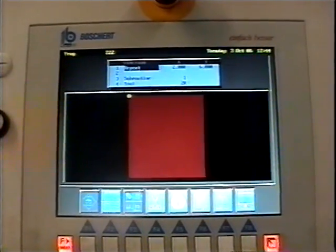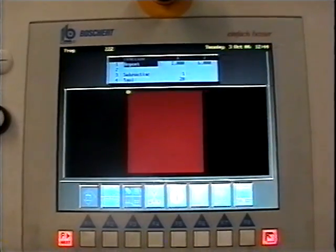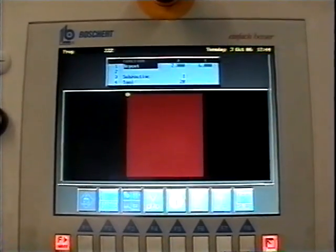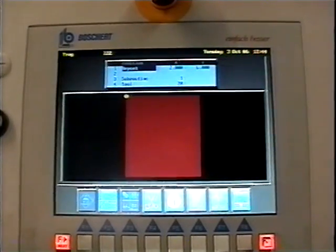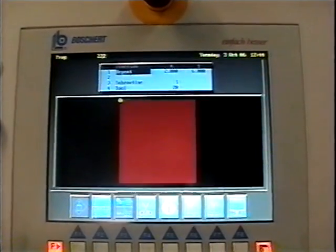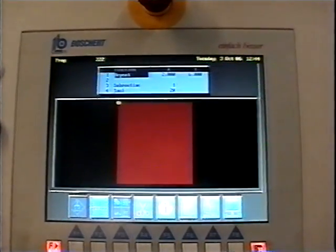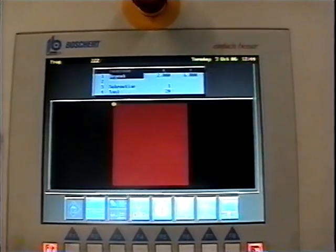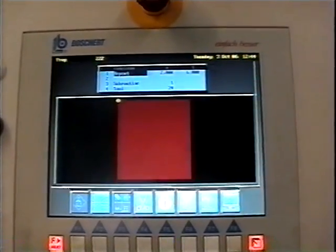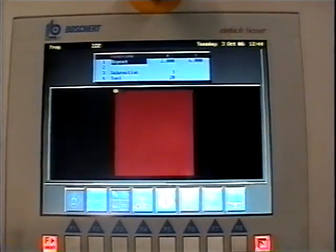It's completely conversational. In the situation where we're running hinges, we have a special tool defined in the library and we've made a very short program — easy to build. It allows you to program both absolute and incremental dimensions for the single hinge from our print, and then repeat it up to any number of times in the X depending on worksheet size, and any number of times repeating in the Y. It simplifies programming considerably — we only have to program one part and then tell the machine how many parts in X and their spacing, then how many parts in Y and their spacing. As you can see, the program is very compact, simple, and fast to make.